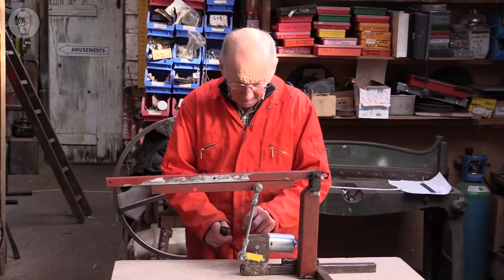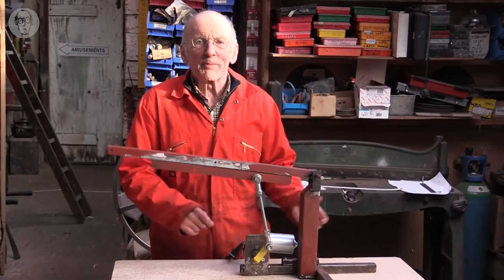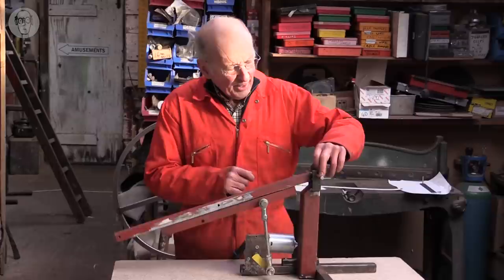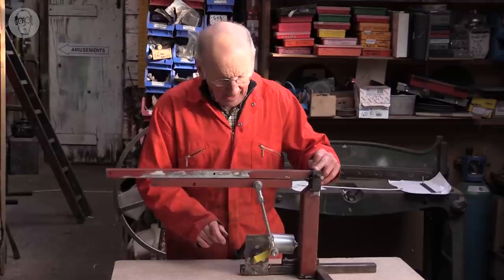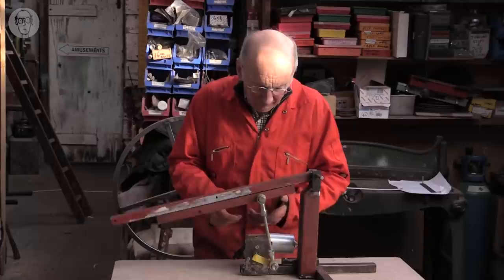And then we have the linkage powered by the crank. This is a useful example to show how sometimes you want rigid joints and sometimes you want flexible joints. So this one is kind of a fixed hinge there. And of course the motor shaft is also fixed. But that means that it's actually better to have rose bearings with a bit of flexibility at both ends of the crank, just so the bearings can't get stressed.